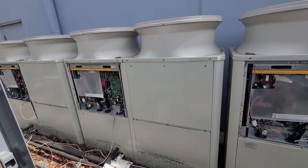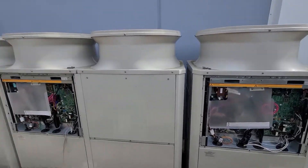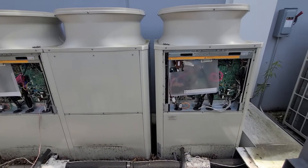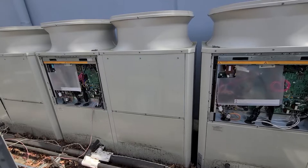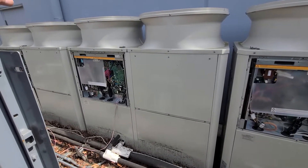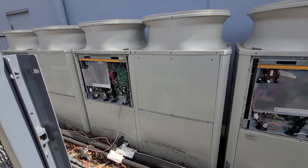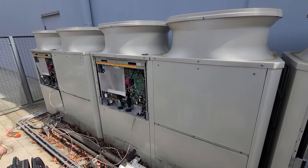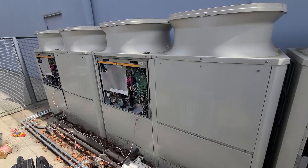I talked to tech support and they gave me some ideas. I tried disconnecting everything off the TB3 terminals to see if I had voltage on any of them. When I pulled the wire off all of them, I picked up voltage off the middle one — which is all you're supposed to have when they're twinned together. There's only supposed to be one that's the main power source.